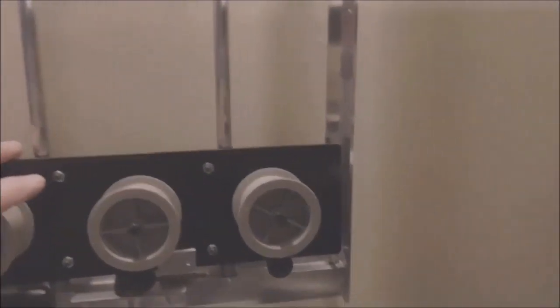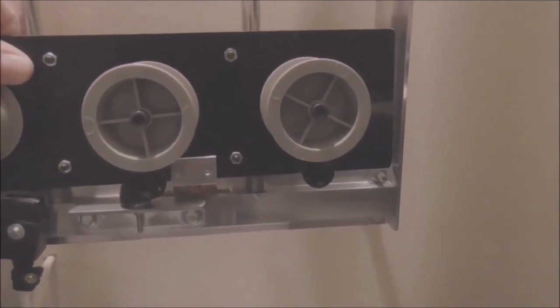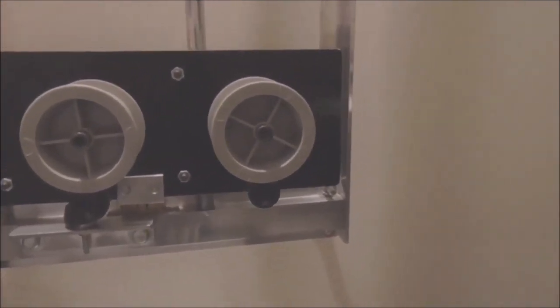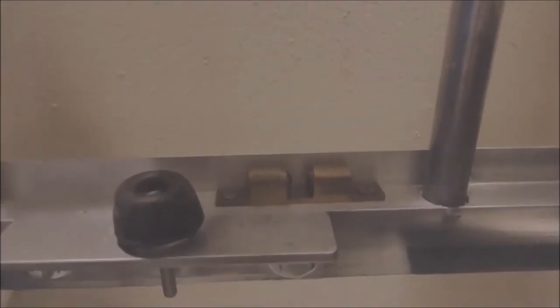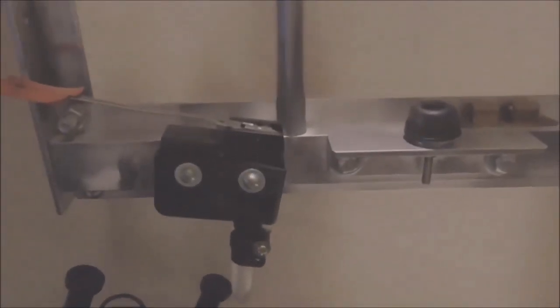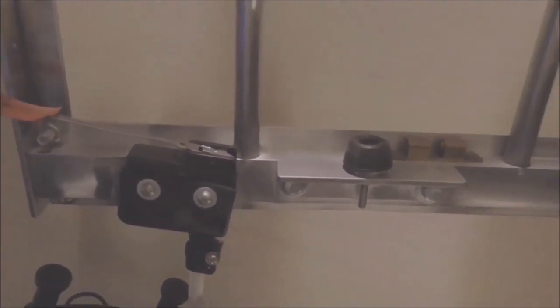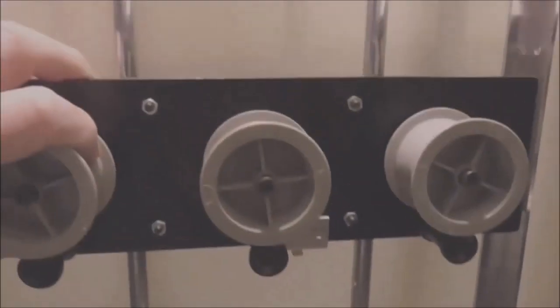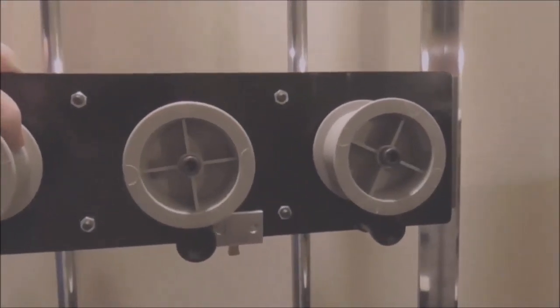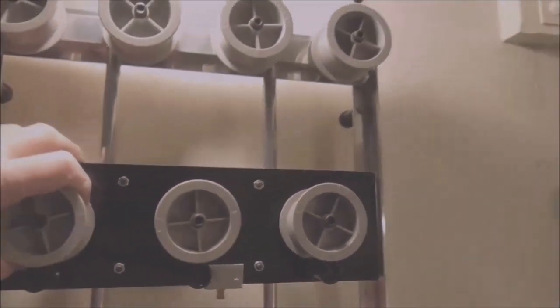In the event of a wrap up in the platter, I've made this little device here, which is pretty good. If the film becomes under load between the projector, it simply pulls out of this latch, which is nothing more than a cupboard latch you use in your kitchen. And as it pulls out of there, it'll rise. But the micro switch here is wired to that little box in the projection room so that it'll shut the motor down. Being an accumulator, the rundown of the motor, this will just rise and it'll eventually stop about there.